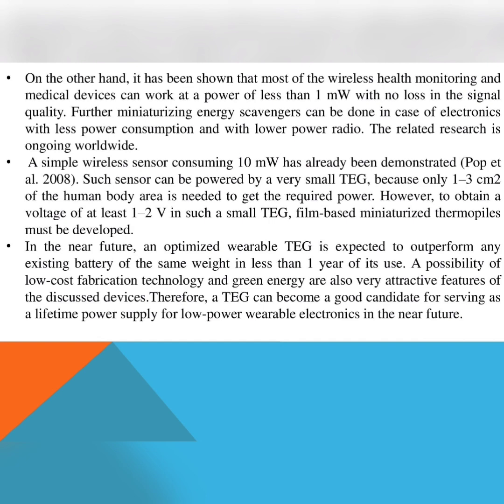By using such an energy storage element, the power gained by a TEG on an occasional basis can be uniformly redistributed and consumed at a near-constant rate over a long period of time. In the first wireless sensor, the electronic module was powered by two NiMH cells at 2.4 volts. The power generated at daytime was enough for powering the electronics and a 2.4 GHz radio, and for transmitting several measurement parameters to a nearby PC every 15 seconds.